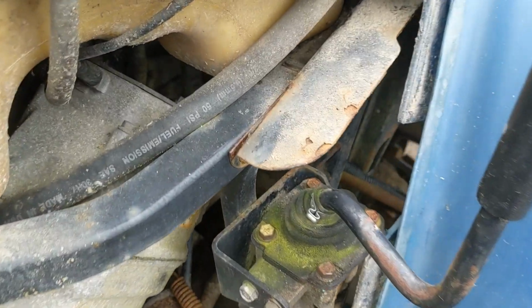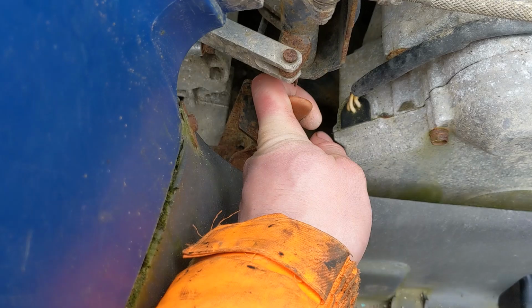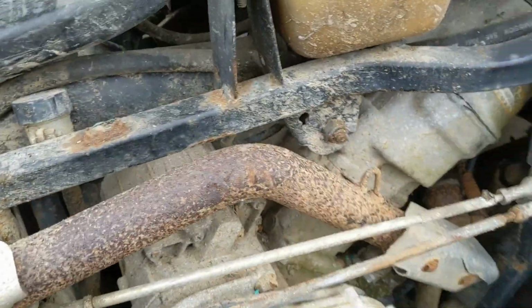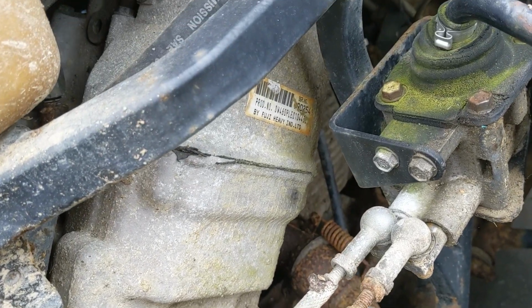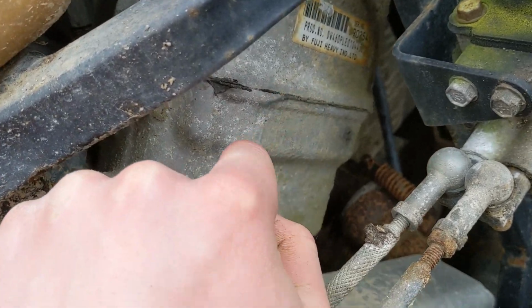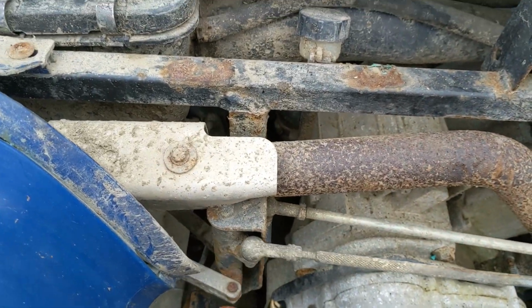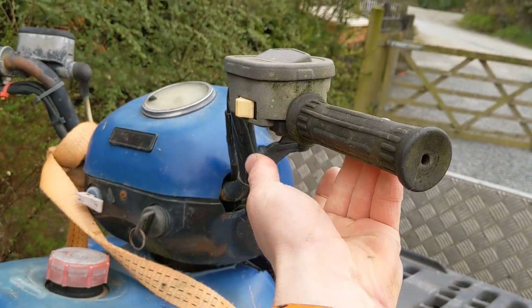Looking inside, the gate is still okay for the automatic. This is the transmission brake. Does that move? No, we'll have to go through that. There's your transmission brake there that just stops on that transmission cog. Surface rust on the exhaust with no holes, as far as I can see. That's concerning. That does look like it perhaps has been apart before. Head gasket's down there. Can't see any obvious signs of people messing about with it. Still shifts alright. Yep, shifter works fine. Throttle isn't stuck.